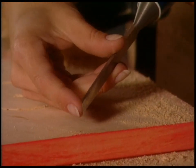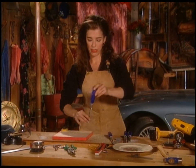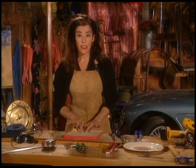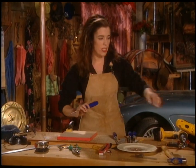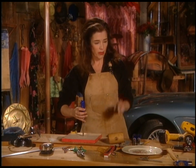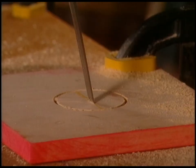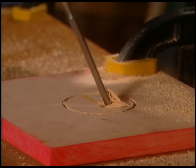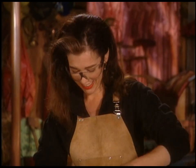There's a beveled side of the chisel and a straight side. It's a lot easier to steer if you've got the bevel down. If you've got the straight edge down, you end up going deeper and deeper into the wood without realizing it. It's easier to chisel with the grain of the wood. I'm going to draw a line to mark so I remember, and take a wooden mallet — it's bigger, so you don't have to concentrate on hitting the end and can watch where your chisel is pointed. Safety glasses on again.